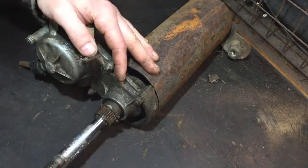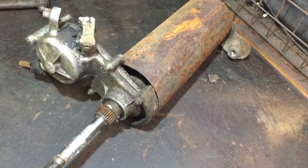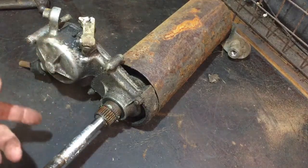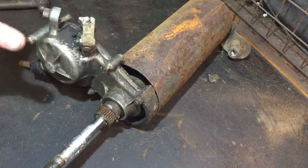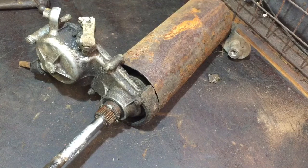Don't think it will go like that every time if you try to do this, because it won't. I've had a bit of a pain like that one the other day. It's nice when it does go like that, but it doesn't very often. It's a good sign on this one because that grease is in there. I'm just going to wipe that grease off. I believe there's a circlip on the end — and there is. We'll get that off and then hopefully the shaft will just push through, then we'll try and get the other side roller off.